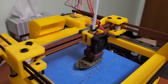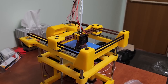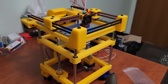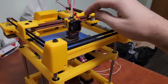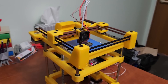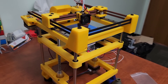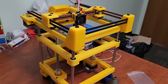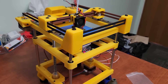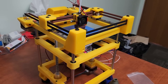I made the tool head very, very simple — it's got nothing on it but the hot end and a fan. You can really easily see your part being printed, which I like. Right now it only uses the two-bolt CR10-style hot end. I generally buy those on Amazon for about $8–$10 and have good luck with them. However, I would potentially like to modify another tool head so you could use a rigid mount hot end like a CHC or Triangle Lab CHC — something like that.